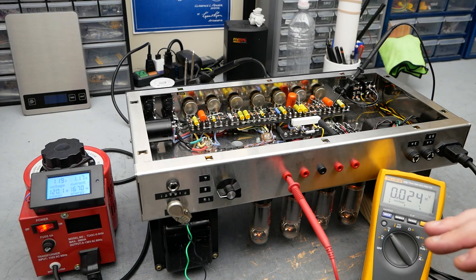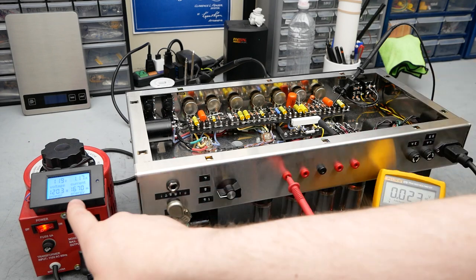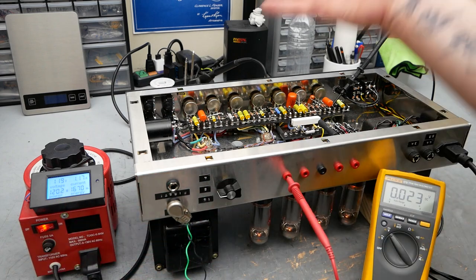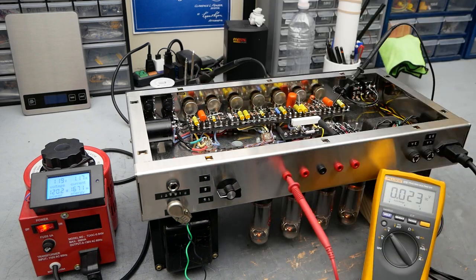It leaves space for your wall voltage to increase. Like I put exactly 120, at least as exact as this meter can be. But sometimes your wall voltage can be 121, 125 volts, and sometimes it can drop lower. I've seen, in the middle of the day, in the summer when ACs are going and everything, as low as like 117 out of my wall voltage.